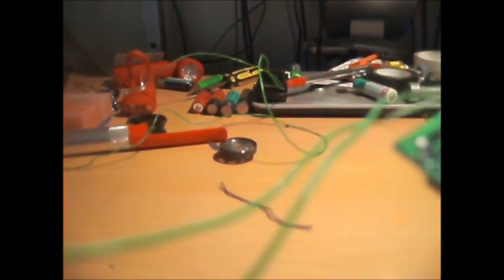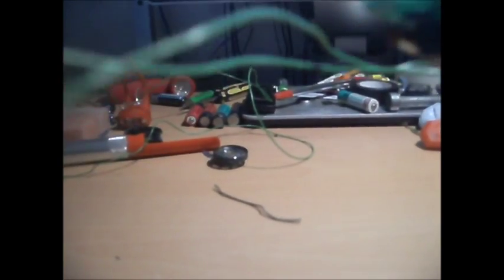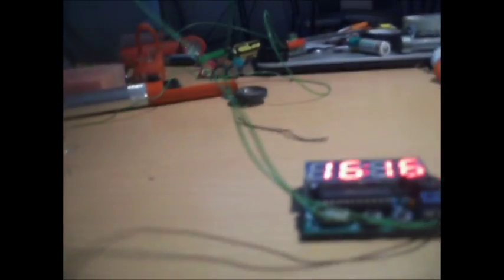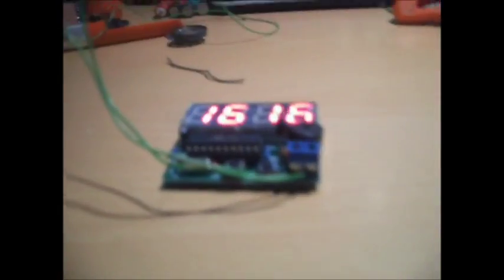The one thing, when you've got a big soldering iron like that, it seems to be quite easy to get shorts. I'll go through with the magnifier again and just make sure the buzzer isn't shorted anywhere. Actually, I can't see any more shorts looking at it like this. So I don't know why that's not working. Not that that bothers me, I only wired it for the clock anyway. It's meant to run 5 volts. I've got it on a 6 volt battery, but it works.